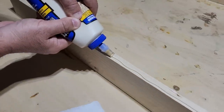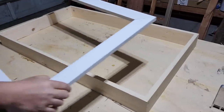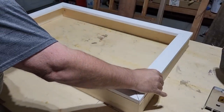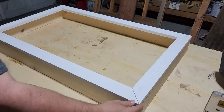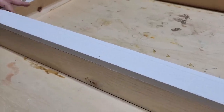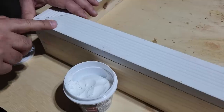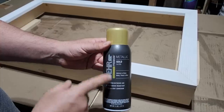We're going to put glue all the way around the box frame we just built, because we're going to lay the frame on top. If you measured right, did good, and took your time, it's going to fit just right. The last thing you need to do is use the brad nailer again and put just a few brad nails to hold it together. Once you get those in, let's cover up the nail holes with a little bit of spackle — just let that dry and sand it clean.